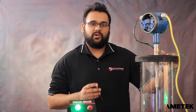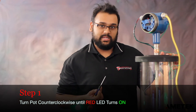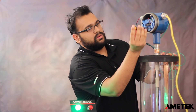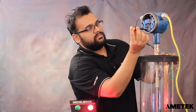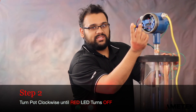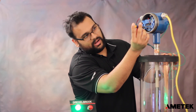The first step in our calibration procedure is to take your screwdriver and turn the sensitivity adjustment fully counterclockwise until the red LED turns on. Now that the red LED has turned on, we're going to turn the adjustment pot clockwise until the red LED just turns off. Turn slowly — and it turns off.